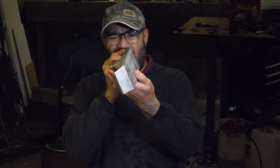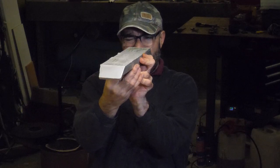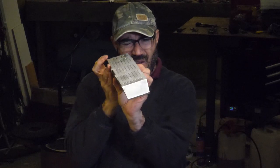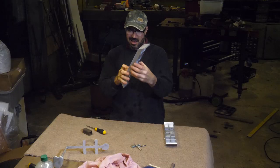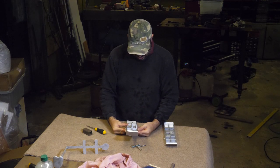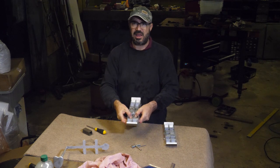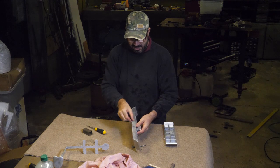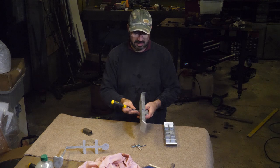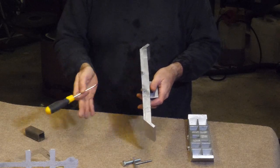So that is interesting. There is a very slight bow to it now. I wonder if it's because this side has shrunk. So this side is the thicker. This is where most of the aluminium is. This base plate here at its thickest is 7 millimeters. So this black bit all the way along is solid aluminium, this side.